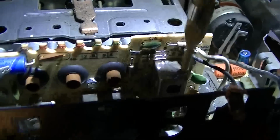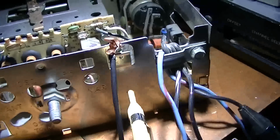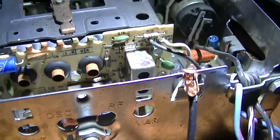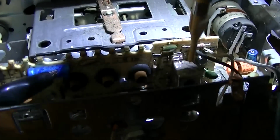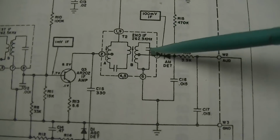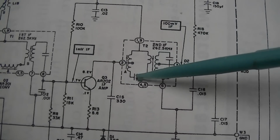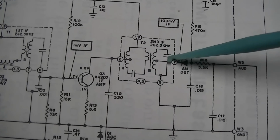Well, the problem is obviously with this one right here, because the bottom one seems like it's peaking when I adjust it. You can hear it shifting the IF, but the top one is not peaking. I screw it all the way in and it starts to peak. So this capacitor has got to be open on this one. So I'm gonna assume that capacitor right there is open, because this is the one I was turning and you could hear it shifting the IF frequency. I have a feeling this one is open,